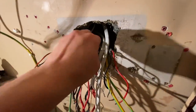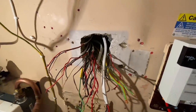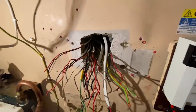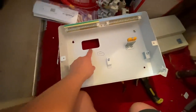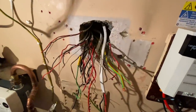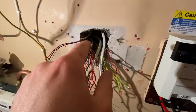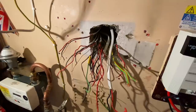If you imagine this was a wooden house — what's going to happen if you get a fire in this fuse board? Luckily we've got brick here. This is how cables used to be brought in through the cavity back in the day, which is a bit naughty. The grommet strip that came with the fuse board is fairly decent, so I'm happy with that. What I'll then do is put my Evermate fire seal in the back, just to give this a bit of fire protection. We know we're not going to have a fire, but it's better to be belt and braces.